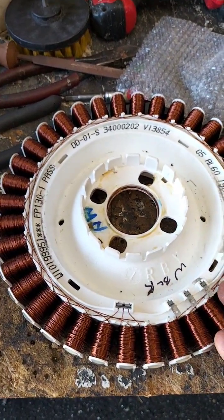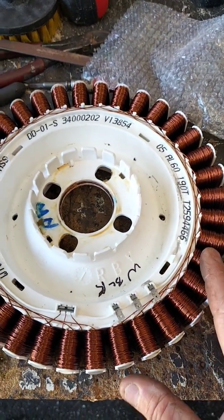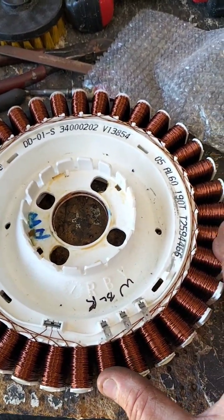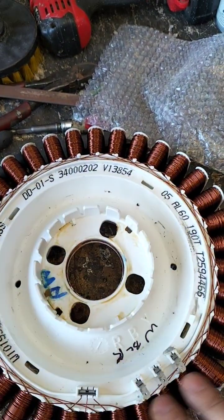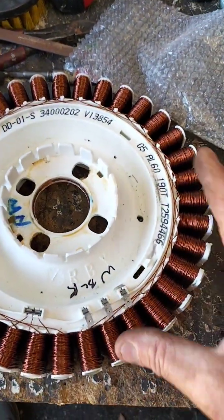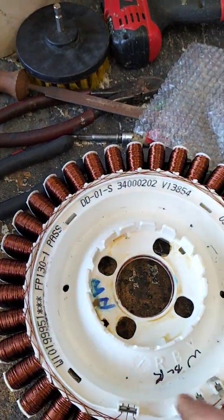Now, when this is a motor, it's the opposite way, of course. But what we do is we're going to rewire it. If you have a look on YouTube, have a look at those videos — you'll see that this has been broken up into groups of six. So I think this is, off memory, a 36-post stator, so it's 36 of them doodahs there. I broke them up into bunches of six, and from those six I've brought them out to those wires.